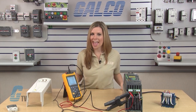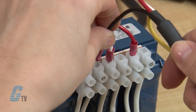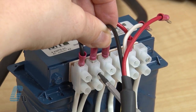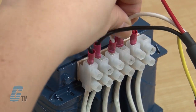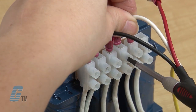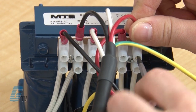I will wait a few minutes to allow the bus capacitors to discharge before touching any of the power connections on the VFD. I can disconnect the VFD input power wires from the power source and connect them to the output side of the reactor, marked A2, B2, and C2. I will connect the input side of the reactor marked A1, B1, and C1 to the power source.